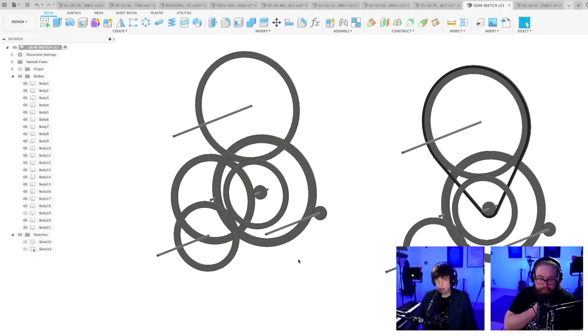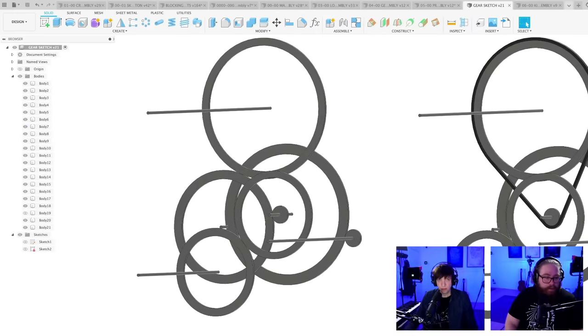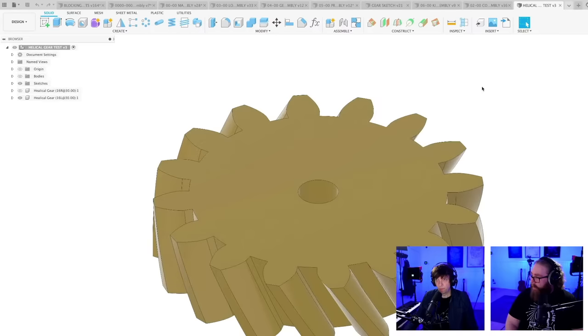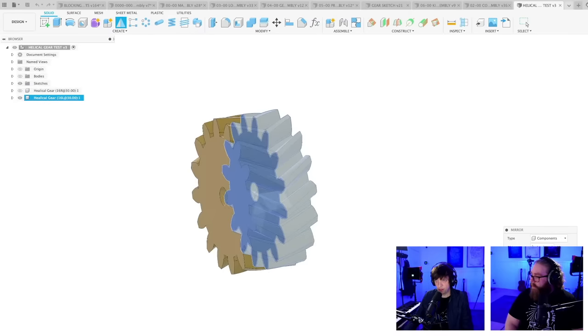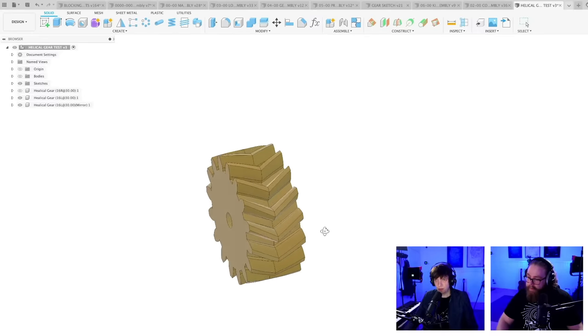So, to the left here, this is all helical plywood gears. Let me just get a helical gear up on screen. I can show you how cool they are. We'll learn to do that in another stream. Helical, where are you? Here we go. So we're going to use helical gear in a herringbone pattern, which means that we're mirroring this gear on its own face like this. So this means that the gear is self-centering, which otherwise can push itself out.